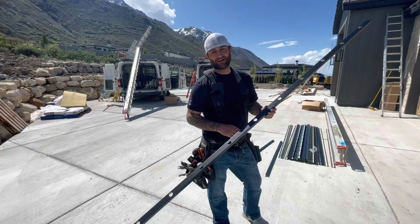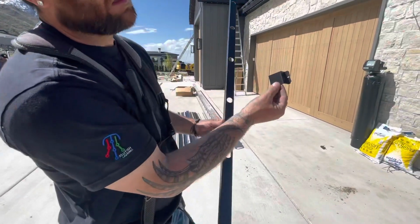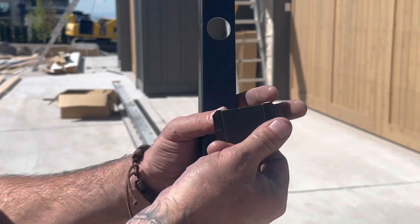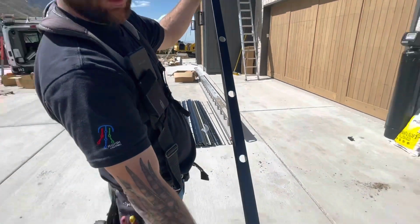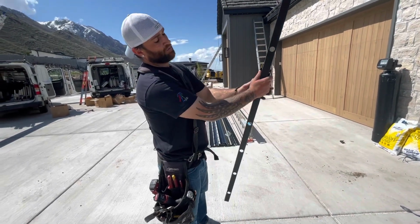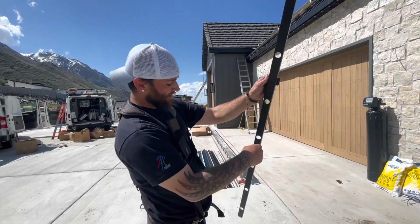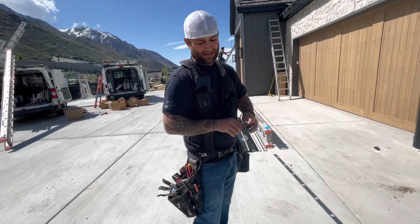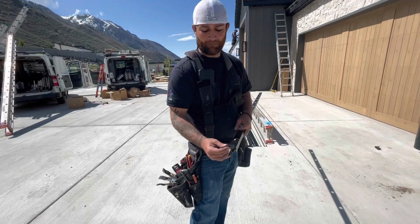I'm Adam. I'm one of the lead installers. This is our clip. It's got holes on both sides. The one side runs right into the fascia, and then we'll put a screw on that back side. And I always, from the end of your track, count in 5 lights, which is dead middle. So when you slide that up against the fascia, you'll put 1 screw in the back. And then I'll go back and put my joint together, where your other piece meets, and then you just put that over the top.